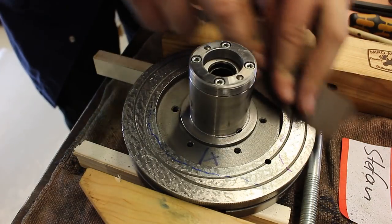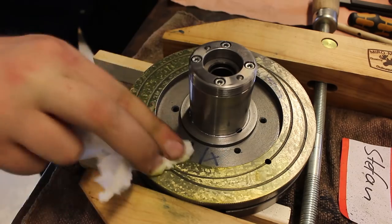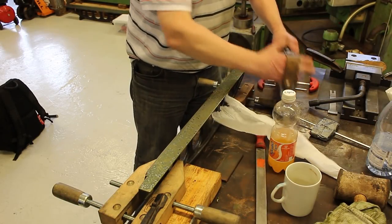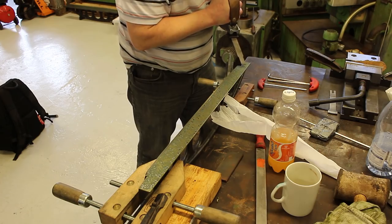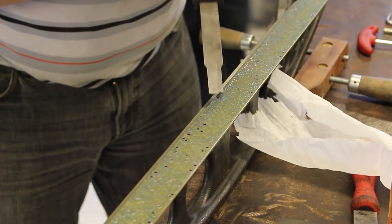Scrape all the way through in one direction. Yeah. Mm-hmm. But you might only be taking off your stepping. It's like a step. John is still working on the camelback straight edge, and here he is taking out the extreme high points that he marked with a magic marker.